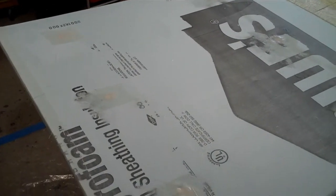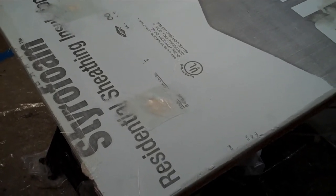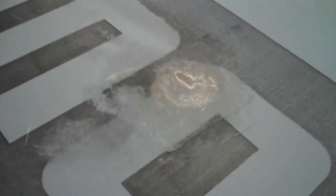All my holes are filled with liquid epoxy glass balloon paste, and then I have these fiberglass cloth tapes over the top of them. I've also used the epoxy putty with a little more viscosity to fill in anything here. I don't mind it being ugly like that because I'm just going to sand it down. It sands really easily. And here I've rounded around or filleted this join between the foam and the 2x4.